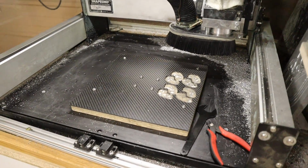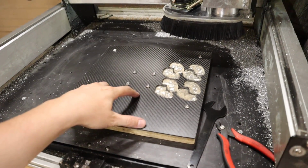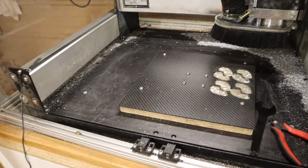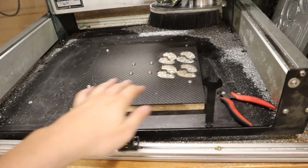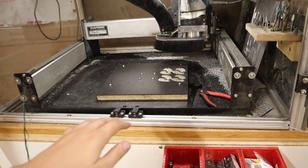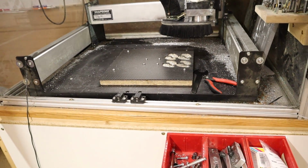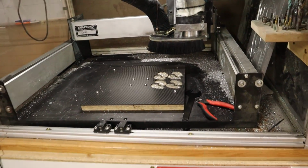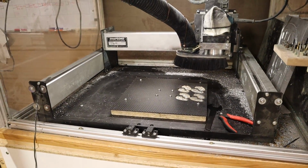And then I'm also working on these carbon fiber shifter paddles. This is how I machine the shifter paddles. I will bolt the carbon fiber down to the bed of the CNC, and so yeah, I can keep it flat. I mean, this obviously isn't a production machine, and so I can have it be, I think, 7 thou across 12 inches, so that's more than enough. I do a chamfer on there, but yeah, that's easily within my tolerance.